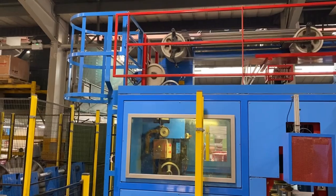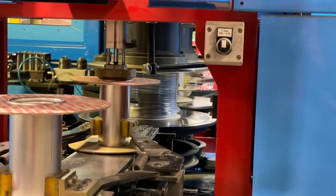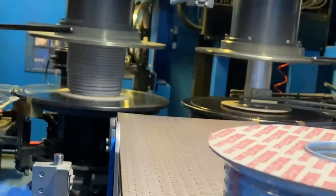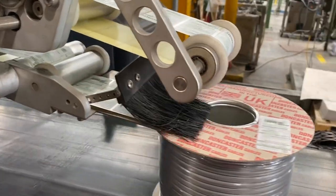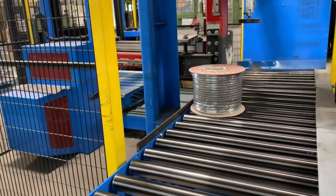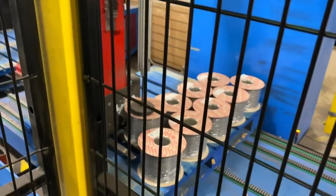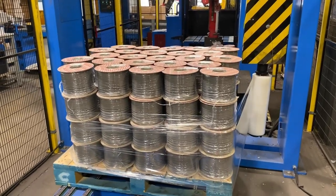Final winding of Twin and Earth is fully automated, winding at about 300 metres per minute - so every 20 seconds a 100-metre reel comes off the machine. The machine has a dual winding head, winding on one side while wrapping the reel on the other for efficiency. It measures to one centimetre, and all reels are wound at 100 metres as a minimum, between 100 and 101 metres. An automated labelling system applies all relevant CPR and product detail information. A conveyor belt then feeds a robotic arm that lifts and stacks the reels onto a pallet. The full pallet is then wrapped and processed into the warehouse ready for dispatch.